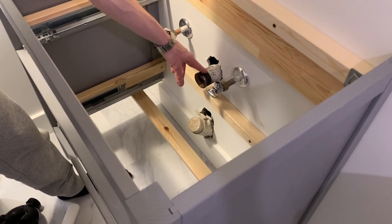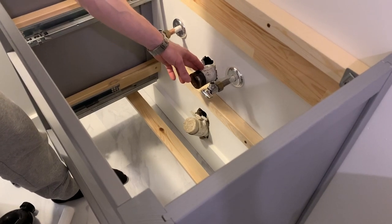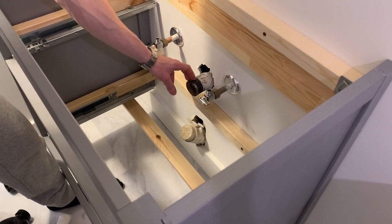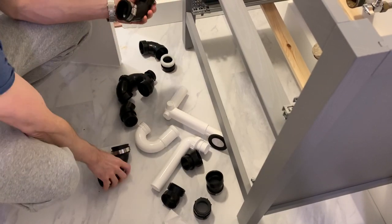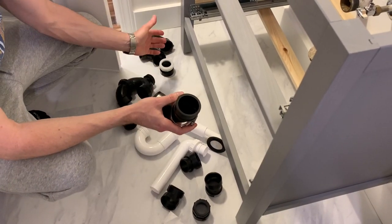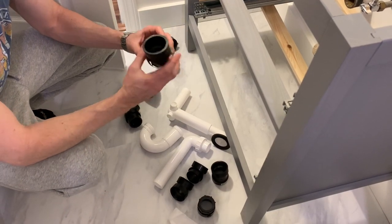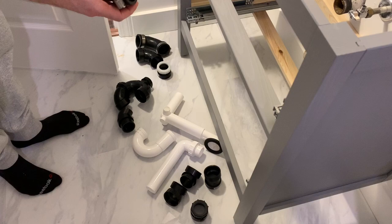The pipe coming out of the wall is a metal pipe — sometimes it can be ABS. I like to cut it down to the wall with maybe an inch sticking out. Since this one is metal I don't want to cut it, so I'm using a 90-degree rubber flexible pipe — I bought two of them. My recommendation: when you go to the big box stores, grab extra elbows and pieces. You can never have too many and you can always return whatever's left over.